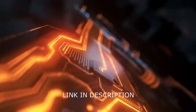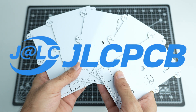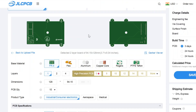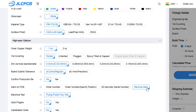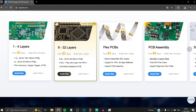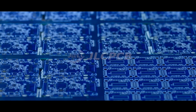Click the link in the description to start designing your PCB with LTM. Once you have downloaded the Gerber file, you need to outsource the PCB manufacturing to a service like JLCPCB, who provide affordable and reliable boards for DIY projects like this. Just head to their website and upload the Gerber zip file to get an instant quote for the Solar Tracker PCB. For the specs, set the board to two layers, choose how many copies you need, set the board thickness to 1.2mm, pick your favorite board color and enable remove order number to keep your PCB clean. Leave the rest of the options as they are. Add this PCB to your cart, then checkout. You can track your order with their fast 24-hour manufacturing and you will receive your board within a week. JLCPCB manufactures 1-8 layer boards starting at just $2 and their quality is top-notch. Click the link in the description and sign up to get $70 in new user coupons from JLCPCB.